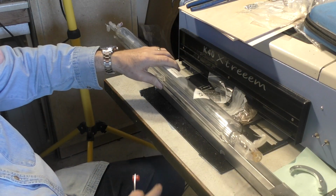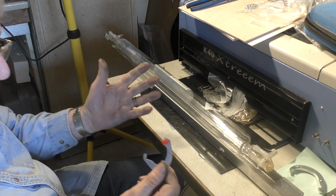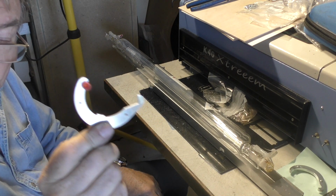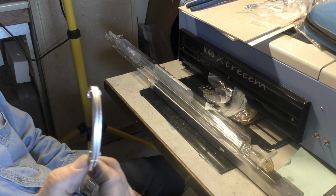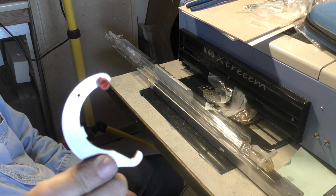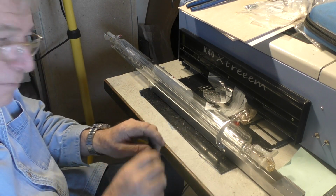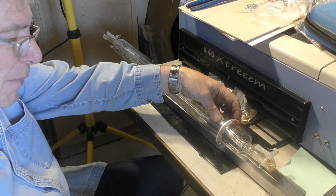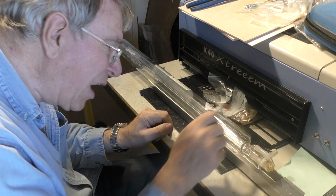So here's a 50mm tube mounted on this channel mount. One of the biggest concerns that I had when I modified these parts away from, I had acrylic versions of this to start with, if you remember, that were 8mm thick. Now my plan was to make 2 of these out of 3mm thick material, aluminium, and bolt them together. When I came to test the shape that I'd originally used for my acrylic version, it's sort of hanging there on a thread just on top dead center, and if I give it just the slightest amount of touch on it, look, pop, it comes off. So that's totally unsatisfactory because it hasn't gone over center enough.